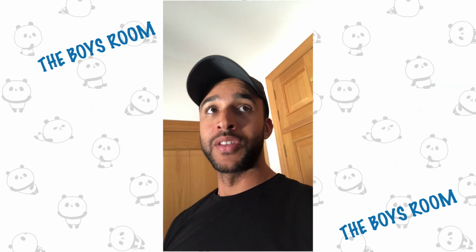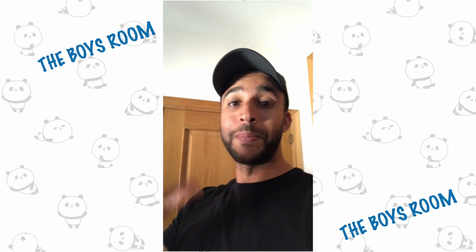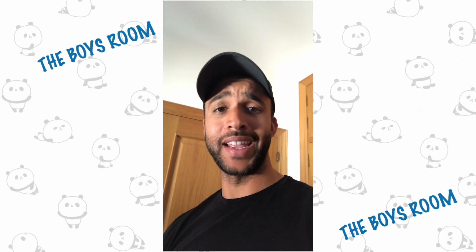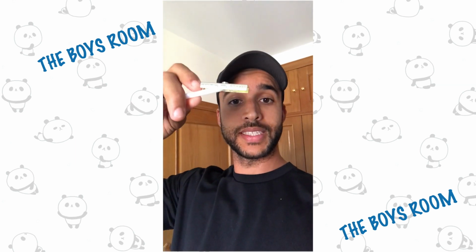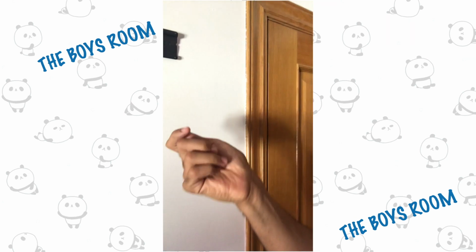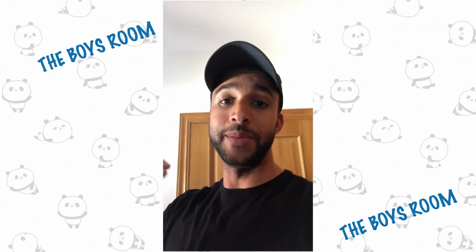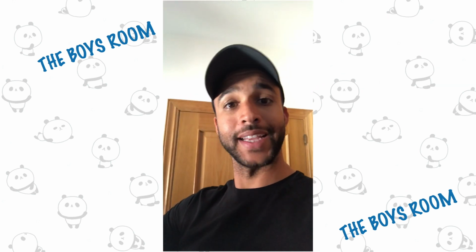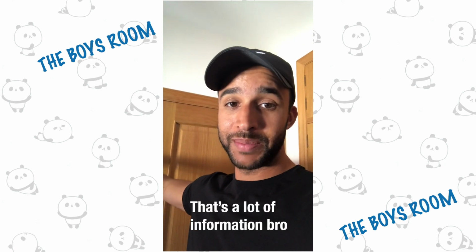So the solution to that is a type of anchor. It's called a snap toggle, I think. But I have to order it and it won't come until the 18th. Not to mention it's like 48 euros. But basically it goes into here and there's a part that flips up. So it's then lengthwise. It goes in and then flips up and then you put the screw inside. So it keeps it stronger in there. It doesn't let it move and allows you to hang things on drywall without a stud behind it. Anyway, that's what I'm doing there.